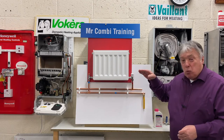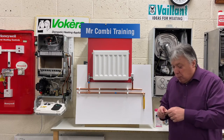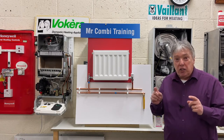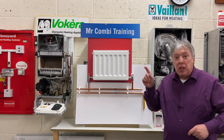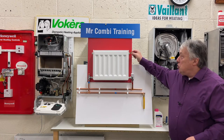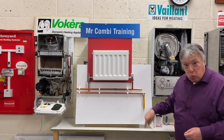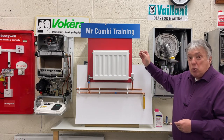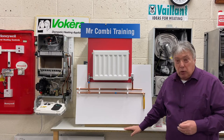Some of that tank water will go down and then it'll stop. So with our radiator key, here's my favorite clock key because these are brilliant, we go to the highest radiator furthest away from where we're draining down to introduce air into it. We simply get our key, go to that highest furthest radiator and gently open, and you'll hear air going in, and downstairs the water will be whooshing out quite quickly. As we undo this valve, very carefully remove it and maybe put it on the window ledge somewhere that it's not going to get lost, because we need to put it back.